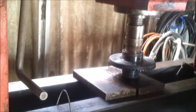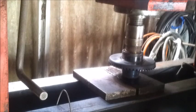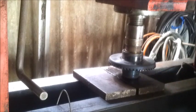Now what? She's gone home. I was a little worried about it when I was hitting her with a hammer, that the hammer's quite strong when each individual blow is quite high. But it didn't quite go in enough, and the part heated up as it was going down, and sort of expanded back out to what it was. So I got point one of a mil interference fit. That's quite a lot for a part that size.